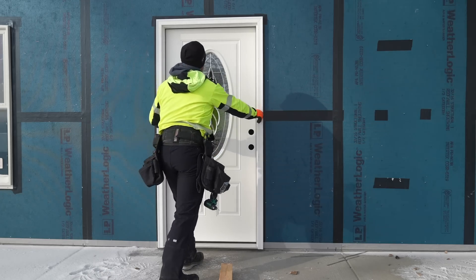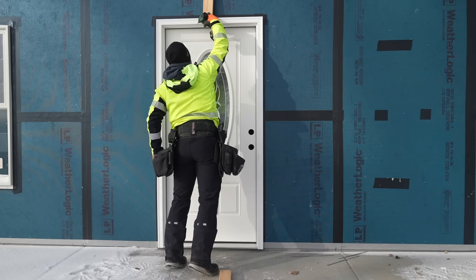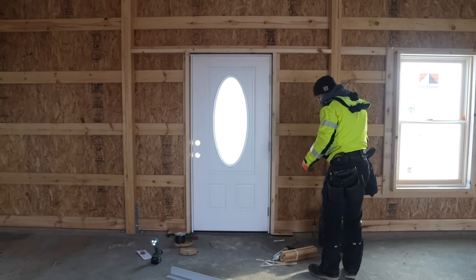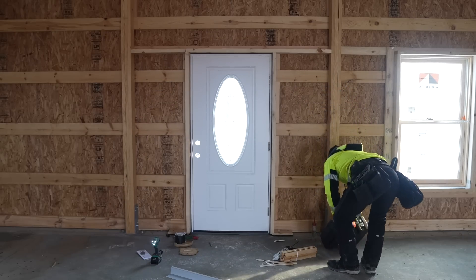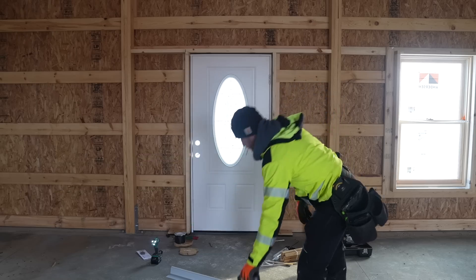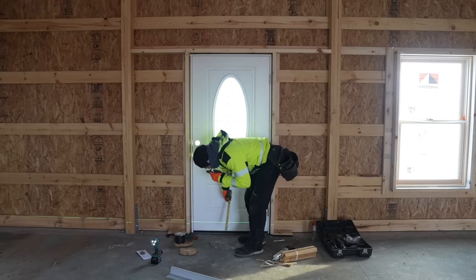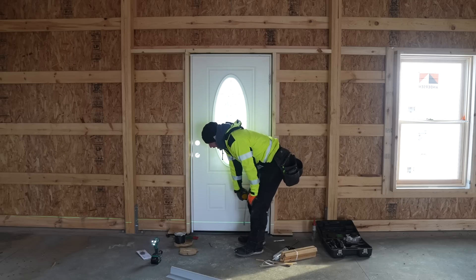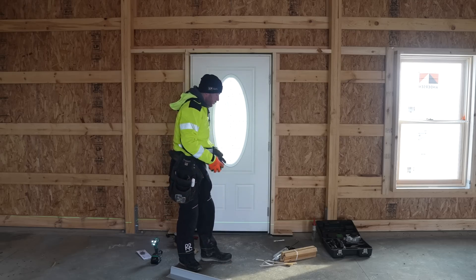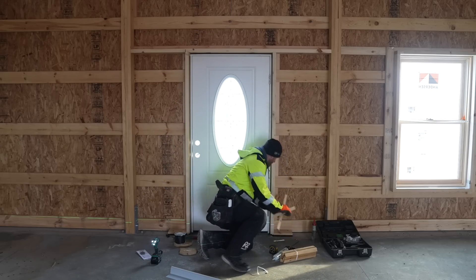Because I'm doing this myself, I'm going to take this and screw it in so it stops it from falling out while I get it set up. This is not looking great because this concrete is not appearing to be very level. Here we're at five, almost seven-eighths; here at five and three-quarters, which means this side is about an eighth inch higher than the other side. Unfortunately, that means this door will not be able to be installed perfectly plumb. We'll see what we can do to make it as good as possible.